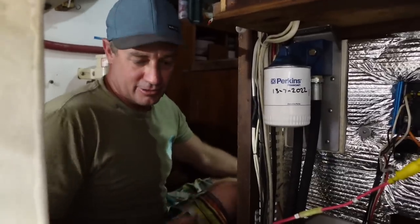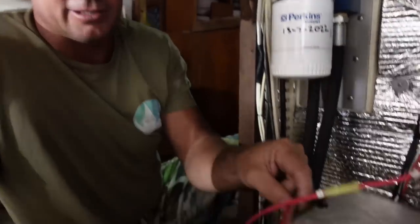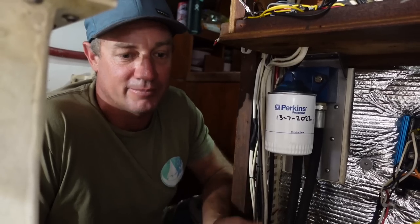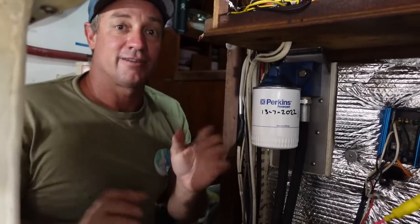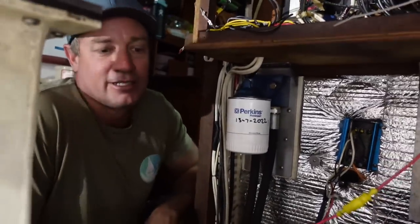13th of the 7th, 2022. I don't actually have the hours at the moment, so I'll add those at a later date. Just start your engine after a service and run your eye around — make sure you've put your plug in, your caps are on, nothing's cross-threaded, and the o-rings are right. Everything seals. There's a lot to be said for running your eye over an engine. Obviously there's wires and stuff hanging everywhere, but I've cleaned up half the wires so we can see the engine. A common thing I've seen in so many people's boats is rub marks on pipes, lines, fuel lines, control lines. If you've got an item rubbing on a motor with the vibration, it's only a matter of time before it'll wear through and you'll dump water, oil, or fuel, lose your control line, or open a line up to corrosion. Run your eye over your whole engine while it's running — if anything is rubbing, put some packing, a bit of tube, zip ties, tie it back — whatever you've got to do so there's no rubbing of any parts.